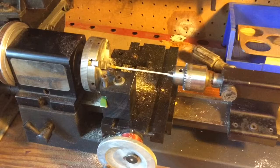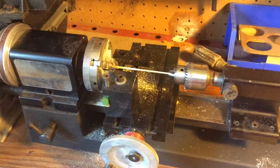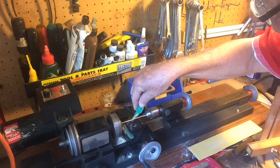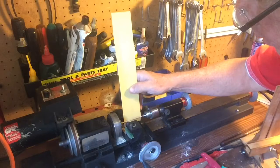So the way you do this is very gently. This is the second one I'm working on. First one broke. So this one is coming out pretty good at this stage. We use the lathe to take the piece down, because I think it's a 4 millimeter post that I was doing, and then a series of different types of sandpaper, all being very gentle.